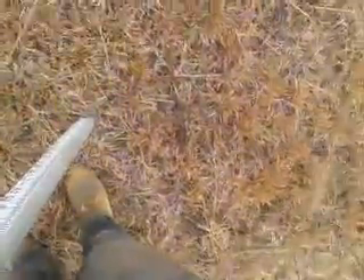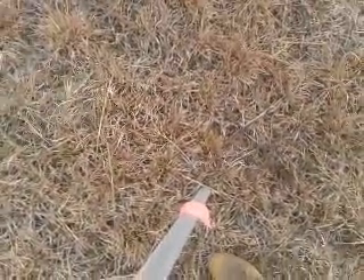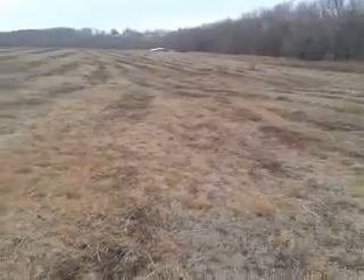This is so I can come back later and plow right around these flags. I'll essentially go around to the right of each flag because it's on the down slope, and that'll just draw water away from the ruts where it's running quickly down the slope along the hillside. So it kind of slows it down and draws the water away from the ruts and into the soil.